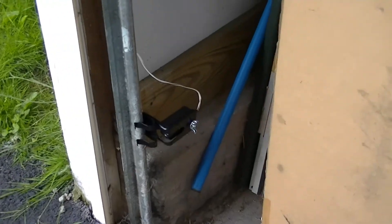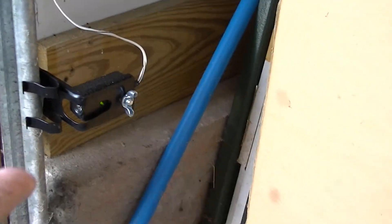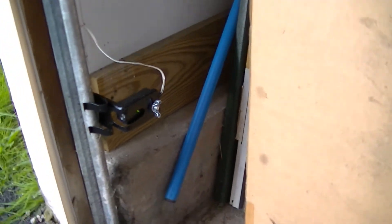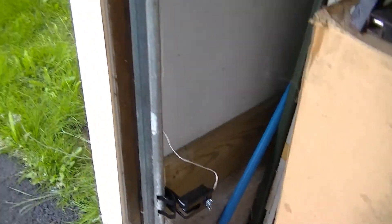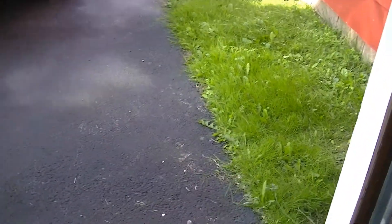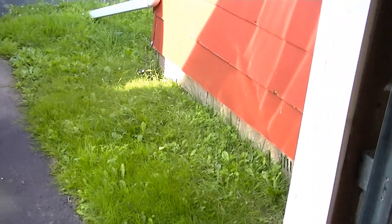If I have something down on the ground, like a kid's head, it's supposed to stop and go back up when it hits it. There are three buttons on this thing — one is for programming and one is for opening and closing. There it goes. Nice! When you hook up these little sensors, if everything is lined up, that little LED light is on — on both of them. So what that should do, kind of like that other safety feature — if the door is going down and I back into it with my foot, it goes back up.